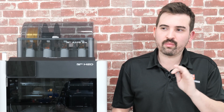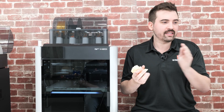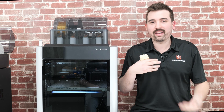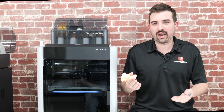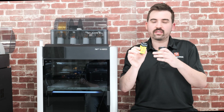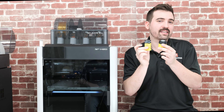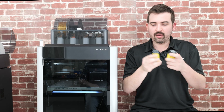There are some situations where you might want to use the whole support as a different material — maybe you have a very expensive filament for the main model and some cheap filament for the support, so you're not using your $100 per kilogram spool on supports. And I have to say it did a really good job — the supports came off really easy. It was super easy to set up in the software. Bambu, the way they are, everything is just really smooth and intuitive for multicolor prints. It still does need a prime tower to get the nozzle set up for the next layer, so it wastes a little bit, but not nearly as much as the old system.